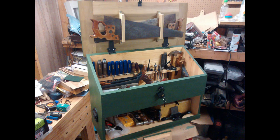In this video I'm going to be going through the first steps of construction of my Dutch tool chest. First I'll be doing the dovetails for the bottom corners of the case. The dovetails basically ensure that the bottom doesn't fall out of the tool chest when you pick it up and it's fully loaded with tools, so it's an important part of this step.